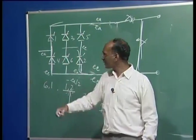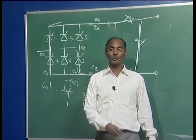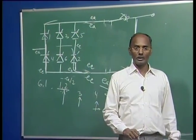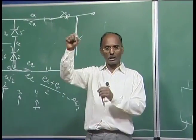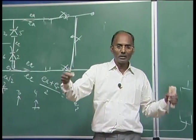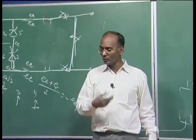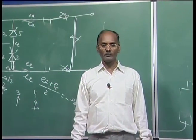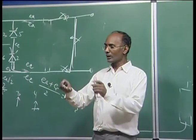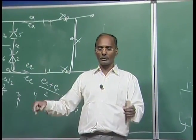Also, we add some extra thyristors to take care of this eventuality. Let us suppose the requirement is 10 thyristors to give the required voltage, we go for 12 or 13, so that even if one is punctured or has some problem, this bridge will still work without any problem. And whenever you require, when the load is less and system conditions permit, then you can take it out.